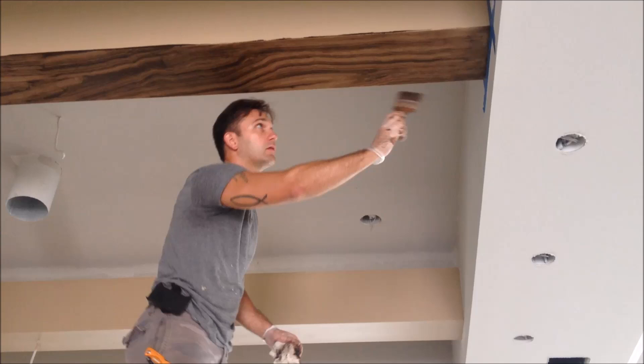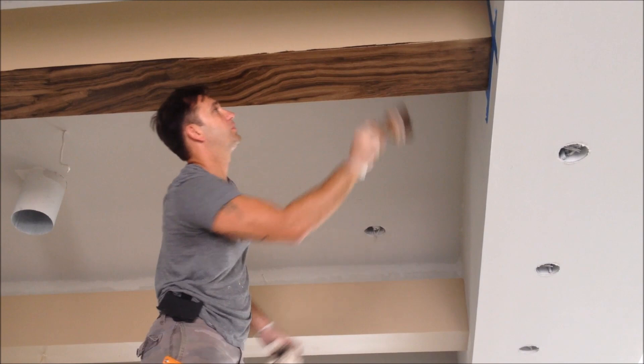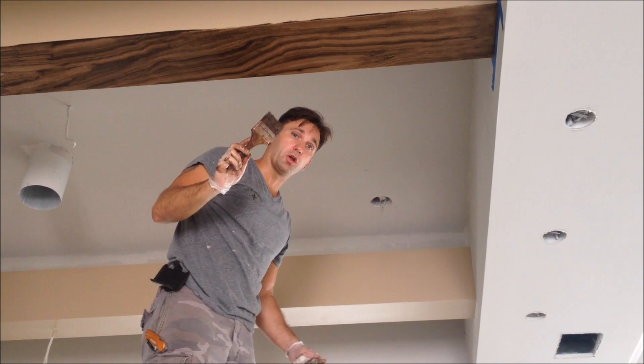So you can fix some of the grains - like this one here that doesn't match up. Just do your touching up with it. Then when you're touching up the whole entire beam, take the dry brush and kind of pull it straight with very, very little pressure. If you put too much pressure you're going to have a deep spot like this, and you don't want that. You want to just kind of let it feather out.